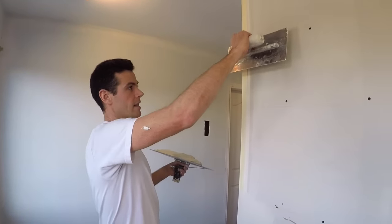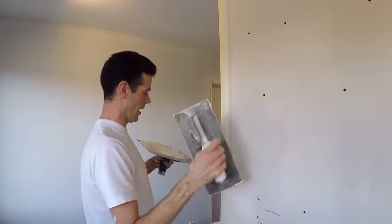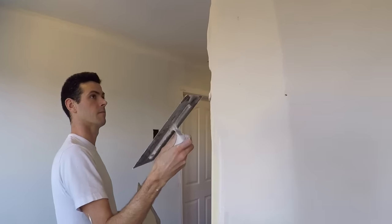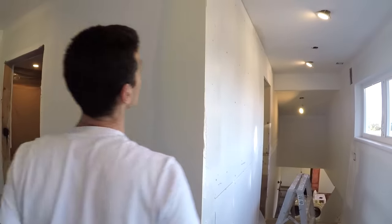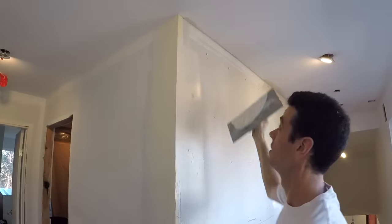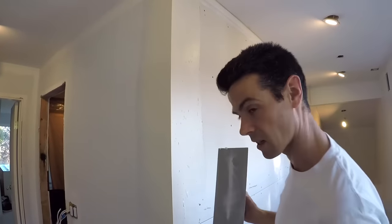Why I like to arc in this direction — here is actually the most important reason why. Let's find out what happens if I go straight down or if I even accidentally arc this way as I'm applying the mud. Look at this — like what am I going to do with that? I've got to pass down here again to fix it. That is why you arc slightly this way when you're loading the bead, because that way you're only just getting this tiny little bit on the bead instead of that massive mess — it's going to wreck your work.